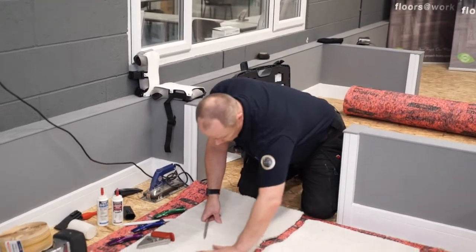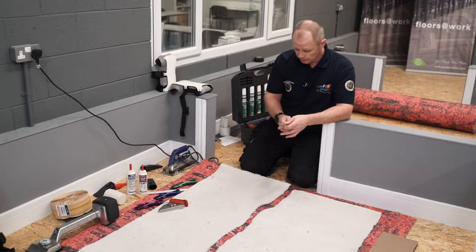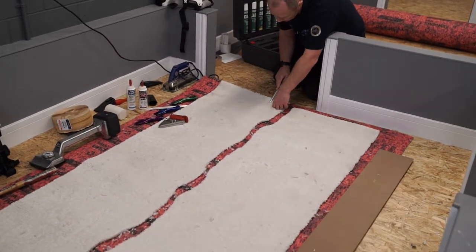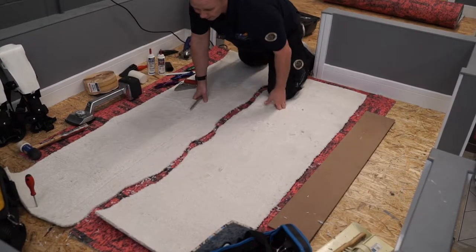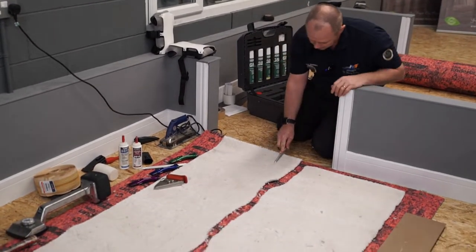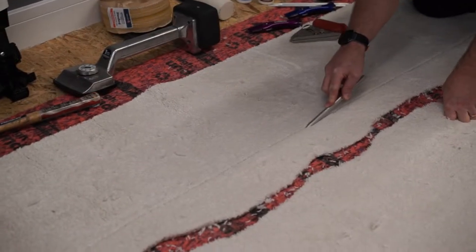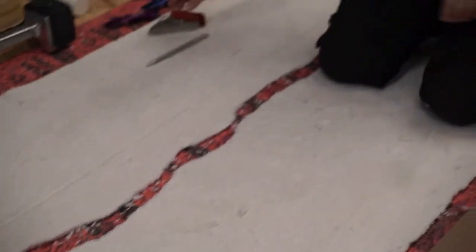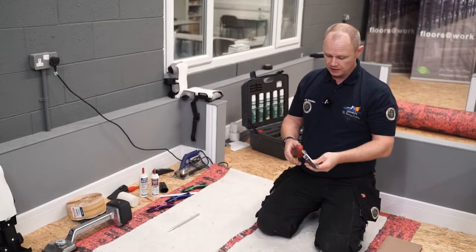With a little bit of carpet, what we're going to do first is use a row-finding needle within the direction of the pile. I've chopped the carpet in a wavy line so you know I can't just pop it back. All we're going to do is follow a line through there — not rub out behind us. We've used the point of the row-finding needle; on the second run we're going to lower the needle down, holding it so we're not rubbing the line out, and widening that line. That makes it a lot easier for the loop pile cutter to run down it and create the perfect edge for heat seaming.